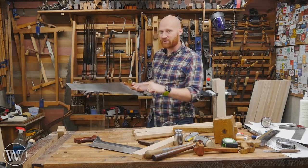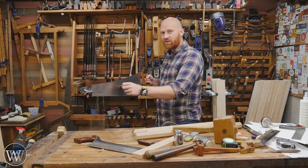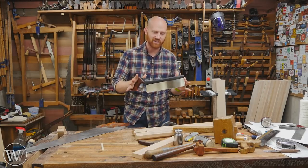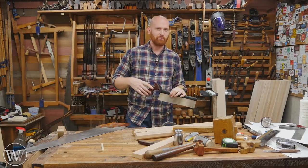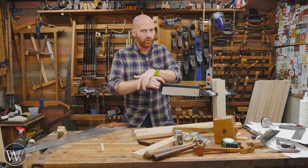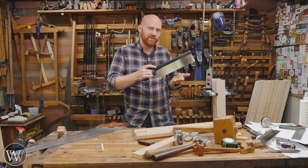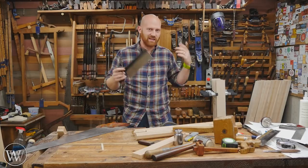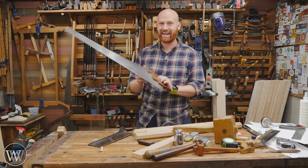Put all these things together and you might be surprised at how easy it is to start a saw, even with really big teeth. This is a back-to-basics topic — whether you've been using a saw all your life or you're brand new to it, it's good to refresh occasionally. Body mechanics can change over time, so remember: hold the weight with your wrist, don't let the saw dig in, don't push the saw down — hold it up so only a portion of the saw's weight is going into the work. Keep all those things in mind and it's amazing what can be done with a simple handsaw.